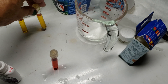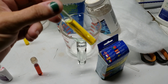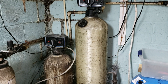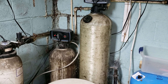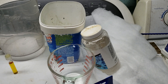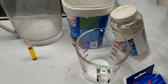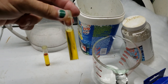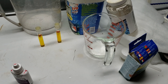That is my tap water — I do have some nitrates in it, and that's not unusual. I get a lot of nitrates in my groundwater sometimes. Even with that exchange medium — that big tank has about 10 pounds of that exchange resin in it, plus my neutralizing medium to get my pH where I want it — it's still showing less than five parts per million. Even when the salt's long gone it's still doing its thing, because even when the thing's fully up and running with salt it still lets some through occasionally.